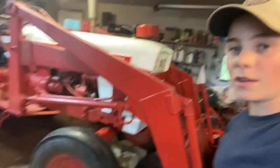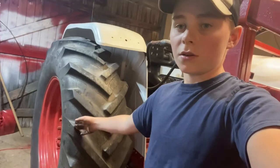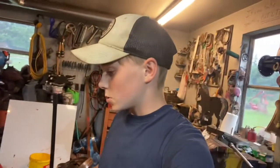The 995 is up on its own wheels now, and no wiggle. Before, you'd be driving in second or third gear and it would be wobbling back and forth, and whenever you'd go to turn the wheels would turn a ton. What we did - since we had the front end apart - we slid in the front axle, since it was out too far. It was out to about the outside of the rear wheel because the front end was extended too far and was starting to bend. The steering rod that hooks to the power steering was also starting to bend, so we slid that in. Now it's right about in the middle of the tread of the tire.